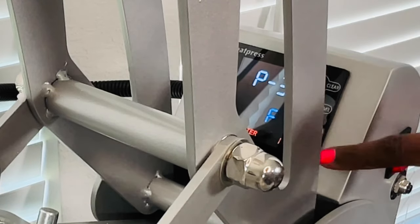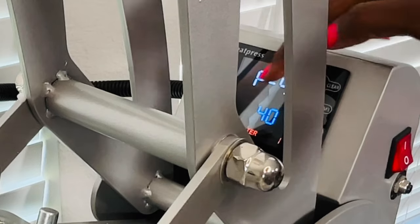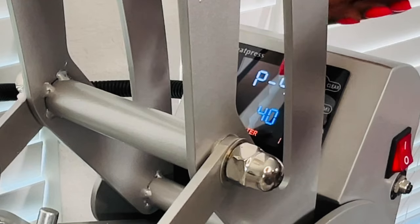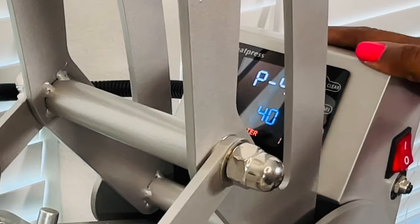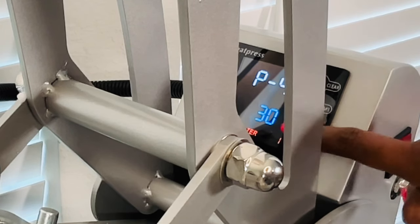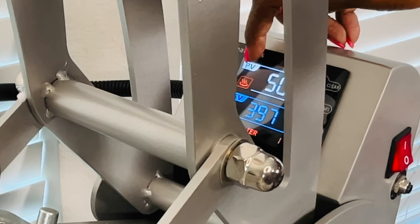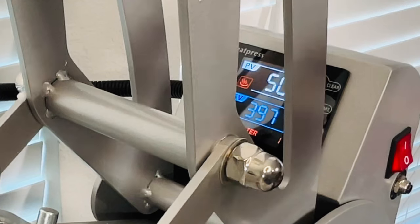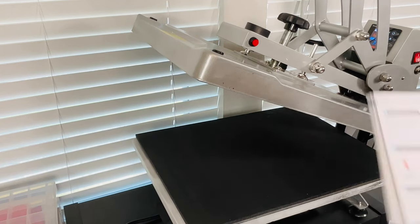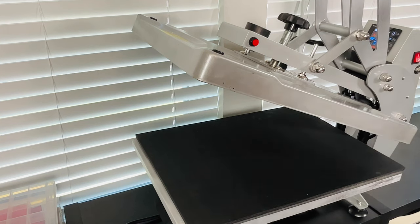Press set again — P3 is Fahrenheit, and you can switch to Celsius by pressing the up or down button. Press set again and P4 is the auto-shutoff timer, which lets you decide how much time before it automatically shuts down. It was set for 40 minutes; I'm going to decrease it to 30 minutes. Now I can see it's starting to heat up. The present value (PV) is currently at 50 degrees and should increase to 400. According to the user manual, page 13, it's recommended to preheat the silicone mat for 30 to 60 seconds to ensure even temperature distribution. I'm going to go ahead and close it.